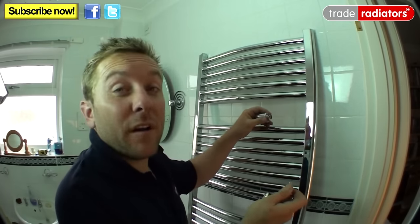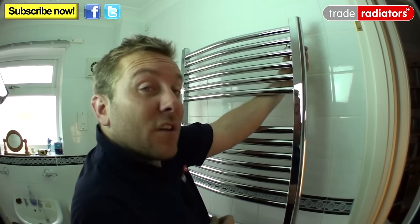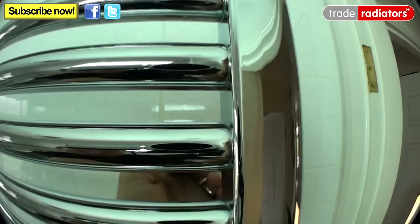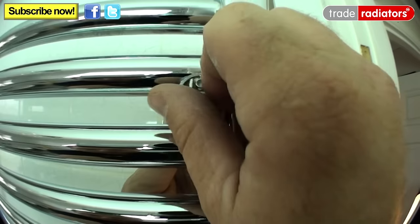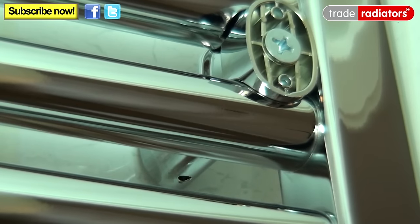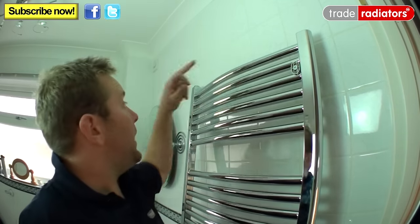Build up each bracket on the radiator itself. Get as far out to the side as possible, pop your back bracket on, then your front bracket, and put the screw through the front bracket. Pop the back piece in, then the front piece, making sure the grooves go in the right place, and tighten with a screwdriver. The key thing to watch for is that the small hole on each bracket is facing downwards. Do that to all four corners — one top left, one top right, and two at the bottom as far apart as possible.